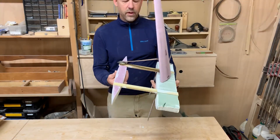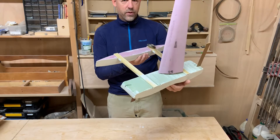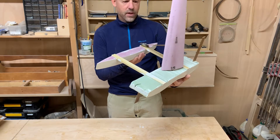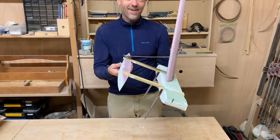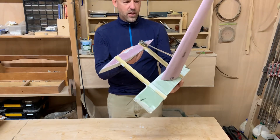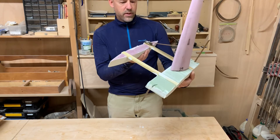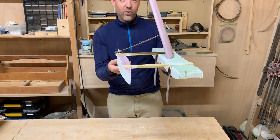The height of the mast is equal to the length of the hulls. On a regular sailboat you usually have a mast that's taller, but because I can't control this, I have to reduce the size — otherwise it'll just flip over and I won't be able to get it back for about half an hour. So I made the sail a little bit smaller than it would be if I was actually on the boat and controlling it. And that's about it — we'll see how it works.